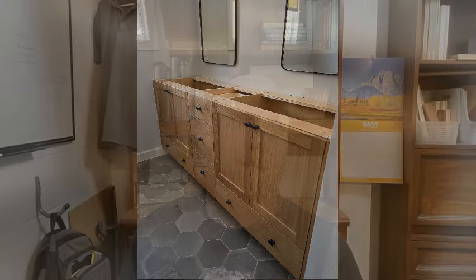I think the best way to do this is to actually do it in 3D design space in SketchUp, which is the software that we use, because that's how I set up my cabinets during the design process. So we're going to take a bath vanity that we recently built for a client. We're going to change that over to a full overlay style and a face frame inset style, and in both versions talk about how an undermount slide setup works and how a sidemount slide setup works. I did put links in the description to both prior videos — one on undermount slides, one on sidemount slides.